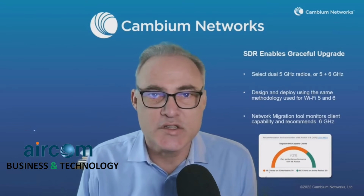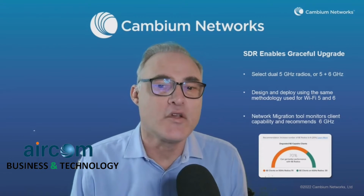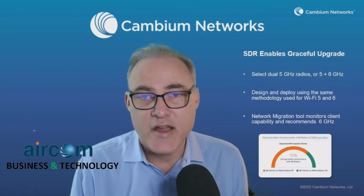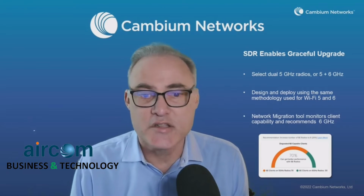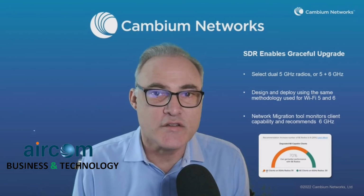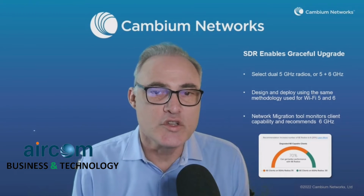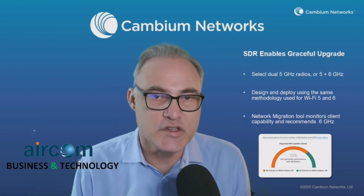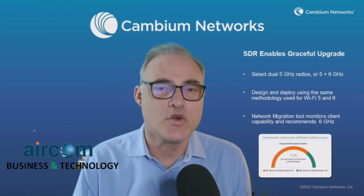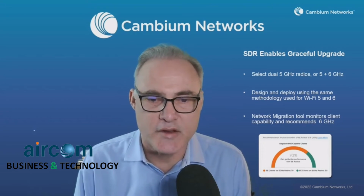So what are the key advantages of software-defined radio? Well, it really is investment protection. It enables you to migrate the network gracefully according to the needs of the client devices in the network and according to other factors that you may be aware of. So you can start out by selecting dual 5 gigahertz mode, not a problem, go ahead and do that. And then later on, you can select 5 and 6 gigahertz mode, enabling that 6 gigahertz radio on the SDR. You can use your existing design and deployment methodologies that you've established right now for Wi-Fi 5. It all carries forward. And then over time, you can migrate your installation methods and your design tools to include that critical 6 gigahertz band.